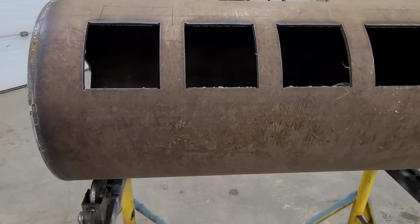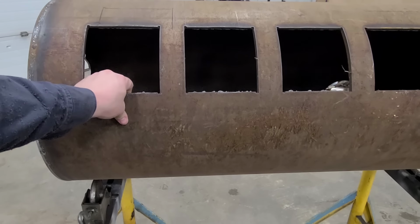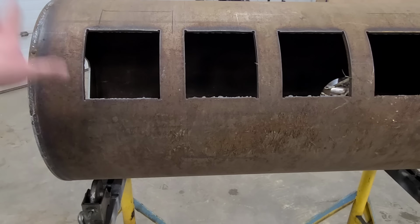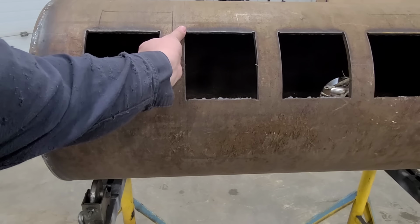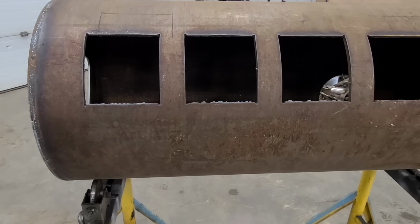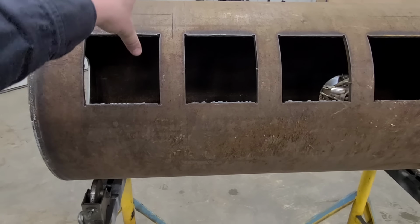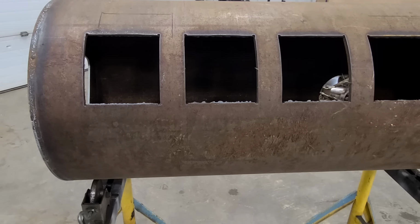So we're going to do a little bit of jumping around here. I'm having some issues welding around those 14 pipes in the heat exchanger. I want to try it over here on these roller stands. I have the bottom up here now, and I already welded this one end cap. That was when I was having a little bit of trouble dialing in the welder. That's good to go now, but we still need to weld the other end cap and then put the bottom on this, as well as the legs, or I should say the ash clean out on this side. So let's go ahead and get that back part welded and get this bottom piece put on, this ash clean out, and we'll get the legs put on it, and then this can come down permanently, and we'll get that other one back up there.